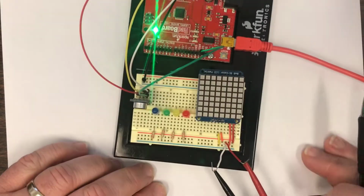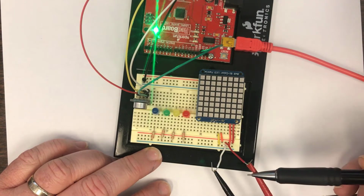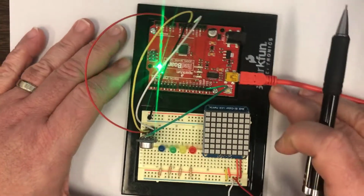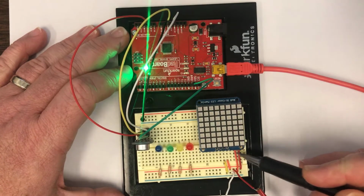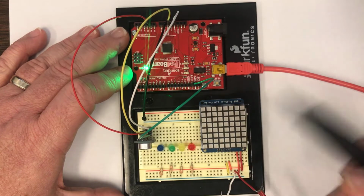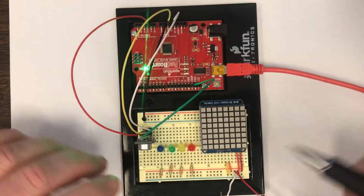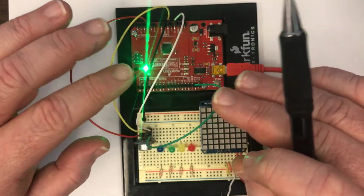First of all, it's probably hard for you to see, but this breadboard is being externally powered by a 5-volt power supply. You'll see these 2 wires right here. These are going to make sure that it's both the top and bottom buses. So even the power up here and the ground up here are connected as well. There are 5 connections that are made from the Arduino to the breadboard.